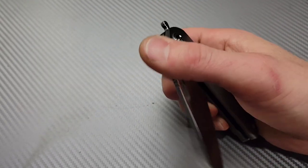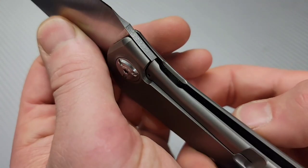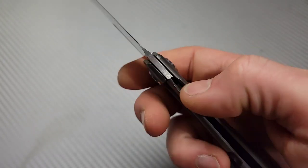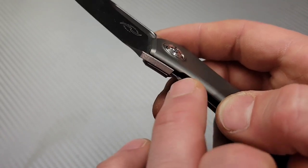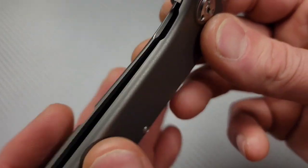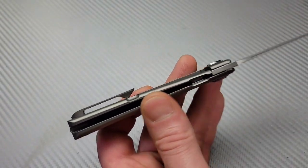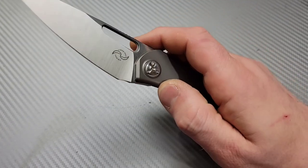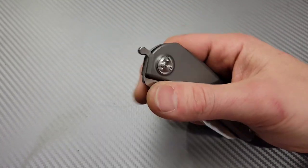I will say there's one thing that stands out already that I hate. It has some pretty strong lockup. But this cutout right here — look how tight that is. There's no access this way; you have to go in the front, and then you have to hit your finger right on this edge. They put a little chamfer right there, but they shouldn't have put this part so sharp. If this was mine, I would immediately cut this out just a little tiny bit, just to give you something so you can hit it from the edge and don't have to come around to the front.